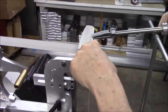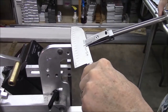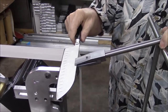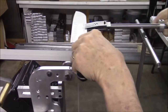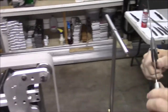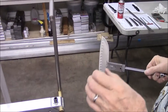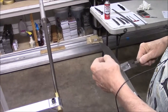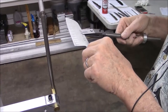The new design makes it so you don't have interference from the handle on a big bulky knife, a bowie knife, or something like that. You just keep going. I go from 1,000 grit up to 2,000 grit. If I'm starting rough, I use a 400 grit belt to establish a grind on a new knife. And that's the sharpening process. Some people like a slight radius or a little bevel using a large contact wheel — it's kind of hard to stay right on top of the wheel, but you can do it.